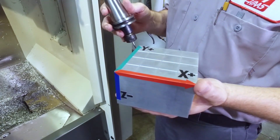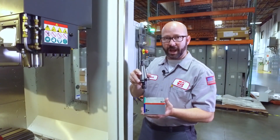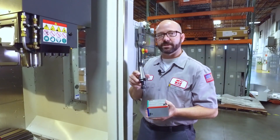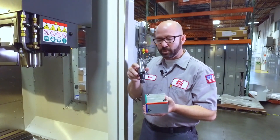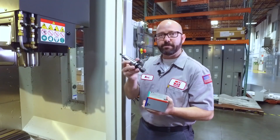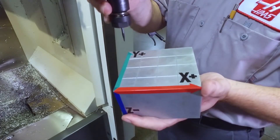On a UMC, if we were to make a rotary move while walking around this block, the rotary would collide with our tool. To program this with a CAM system, you would need thousands of lines of code to simultaneously move the X, Y, and Z axes at the same time to keep the tip of my tool at the correct location on the part at all times.